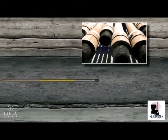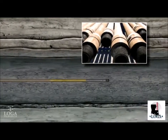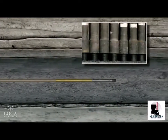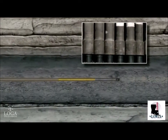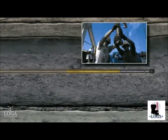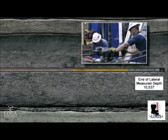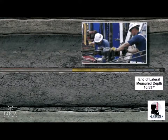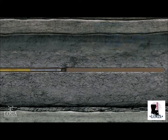The pipe used to drill the well measures 30 feet in length and weighs approximately 495 pounds each. It takes over 350 pieces of pipe, weighing nearly 87 tons, to drill a 10,500-foot well. At various stages of drilling, the pipe is taken out of the hole for tool and bit changes and put back in. This process is called tripping pipe. When the targeted distance is reached, the drill pipe and bit are removed from the wellbore one last time.